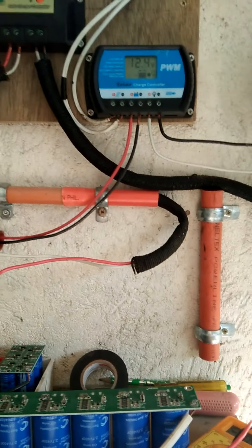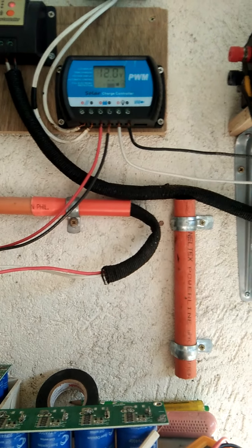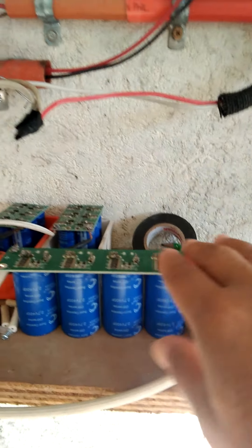During the night, the battery will be connected as the third part of the system, installed here. It will be tapped to the solar panel output as well, so as to charge it, and it will be the resource that powers up the loads during the night. While in the daytime period, supercapacitor number 2 and supercapacitor number 1, as shown by this FMSGR scheme number 8, will power up the loads. In that scheme, the battery life will be extended by 50%, since the battery will only be discharging during the night, whereas during the daytime the supercapacitor will take the place of the storage battery.